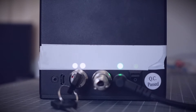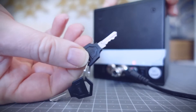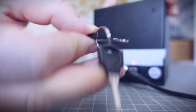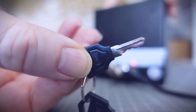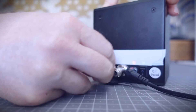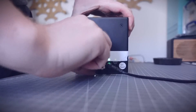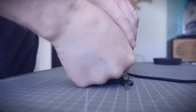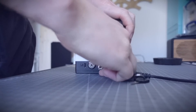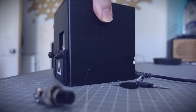One other thing I'd really like to fix is the key switch. The way it works is that when you turn on the laser, or if you re-engage the emergency stop interlock, you need to turn the key switch off and on again otherwise the laser won't do anything. This is actually a safety requirement in some regions, but when you're working at home it can just be really annoying. I'm going to try and figure out a way to get around this, but obviously if you're using this laser outside of your home it's something you probably should check is still legal.